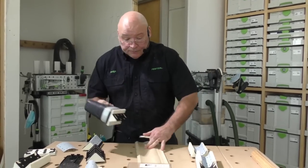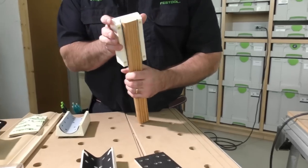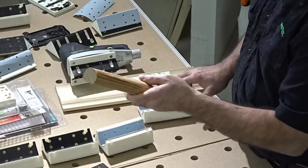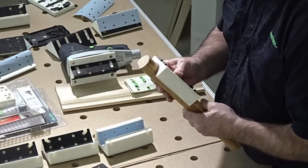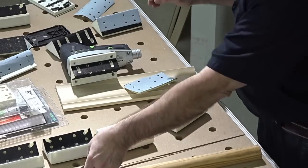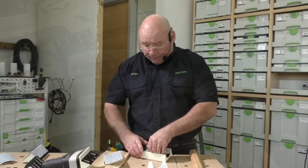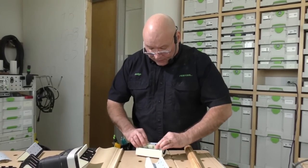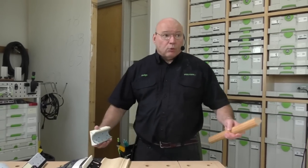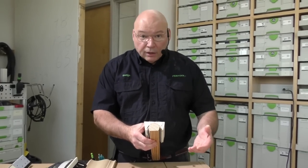Another way to do it — this one is pretty much a perfect fit for this handrail. But if I have this pad with a larger radius, get that interface pad in there and it knocks it down to a tighter radius for this application. That was a big epiphanal moment for me when I was on a job site working with interface pads — I went, 'duh.' You can utilize those interface pads with different contour pads to match different radii. All the different radii are in the catalog.